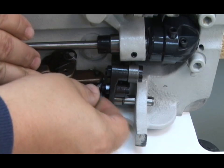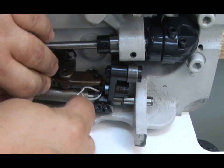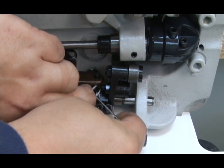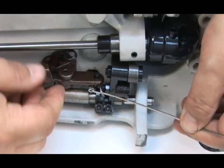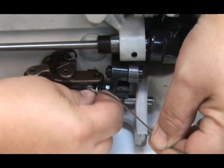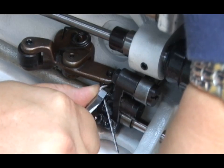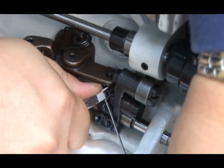And then we'll feed that NicoPress sleeve up through the top and roll it around. This may take a little bit of time and a little bit of effort, and it's also helpful to have a second person, which I did not have in this video. That way you can hold that bracket out so that you can actually grab hold of this. And you can see we're trying to feed that NicoPress sleeve through this loop. Using a screwdriver definitely makes it easier.